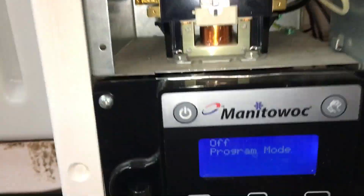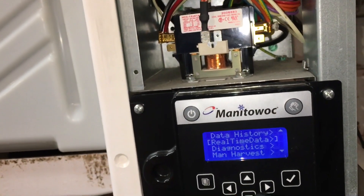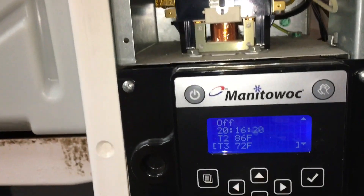Let's check out the sensor and make sure that works. Our new thermistor is just hooked up and we're just testing it — just hanging it in there at room temperature. This room is about 75 according to the air conditioning thermostat. Let's go to machine info, service, real time data, and time and temperature. T3 is reading 73 — or 70, it's laying up against a bottle of CO2 — so 72 degrees. Close enough.